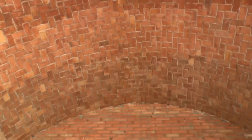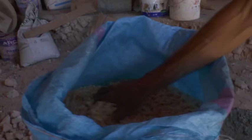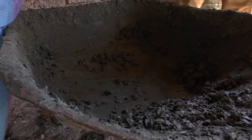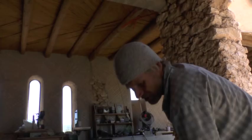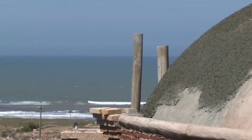We're now doing a layer of insulation on top of the roof. We could have used polystyrene sheets or some modern material, but I was told about a technique using wood shavings and lime. Since the lime here is not great quality anyway, we're using cement — and what it gives us is this really interesting fluffy mix. We're putting it on quite thick up there. It's super light as well, which is good so it's not adding extra weight to our arch.